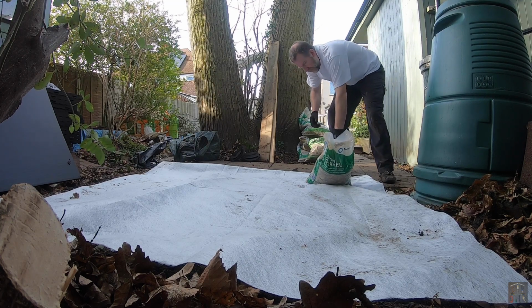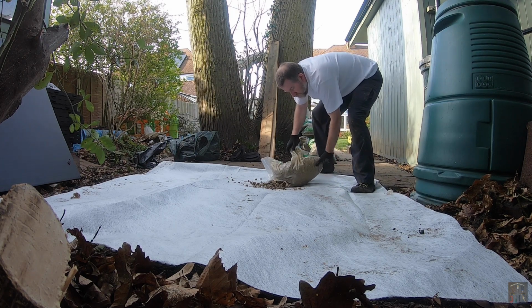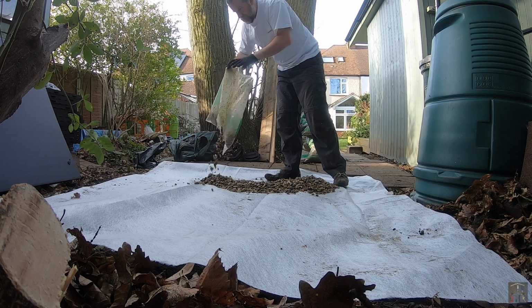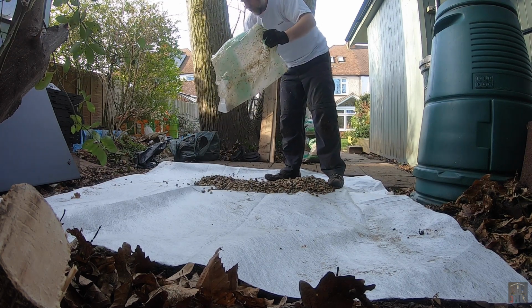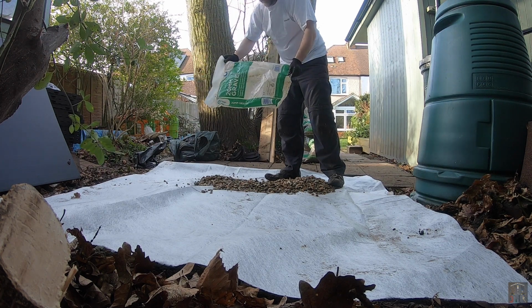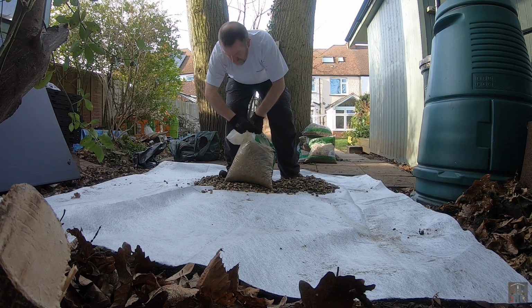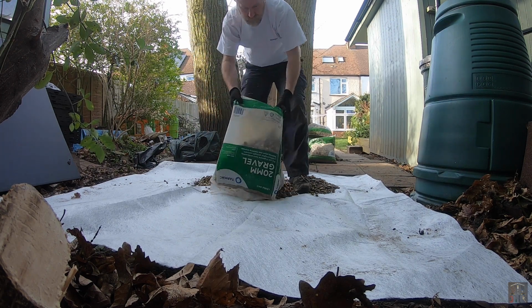And that gravel is basically being used to level up this part of the garden, as it is on a slight slope, as well as fill in all of those surface imperfections from the ground underneath, which I believe in the past was some sort of patio. So the good news there is that overall the base is actually fairly solid, but not that we're actually putting that much weight on this. It's not as if it's going to be used to, say for example, park a car.